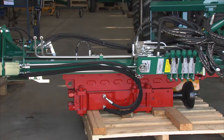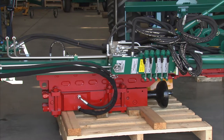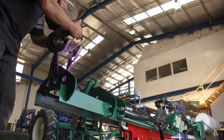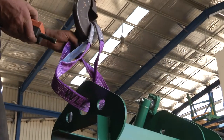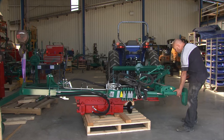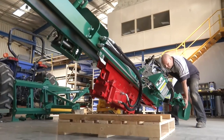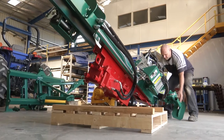To stand it up off the pallet we need some appropriate lifting gear — something that will handle a thousand kilograms. Sling through the top bow to support this side of the machine; that will stop it smashing onto the ground while you're lifting.